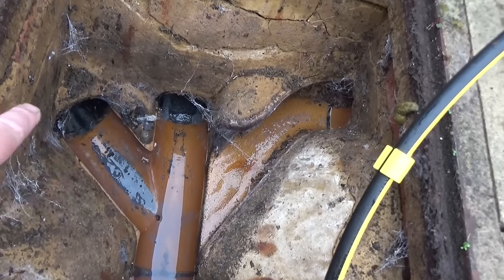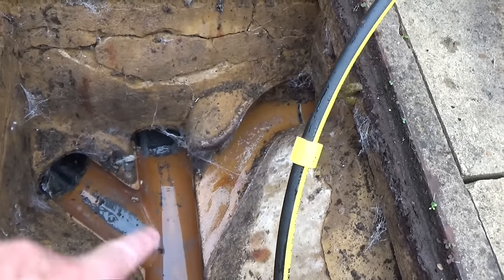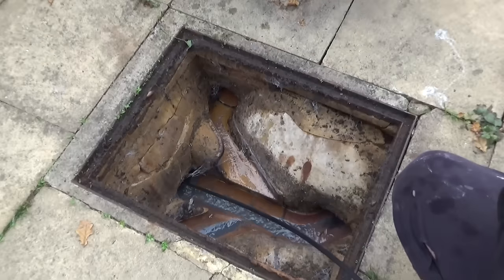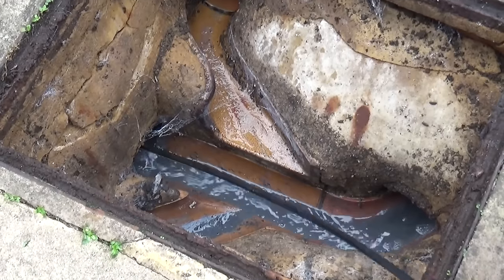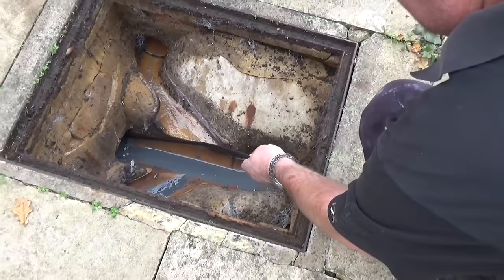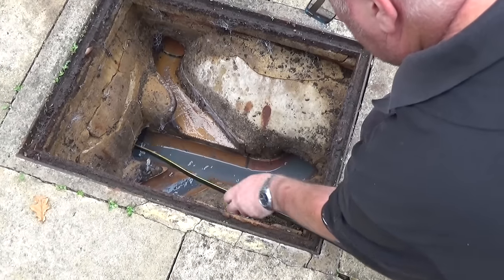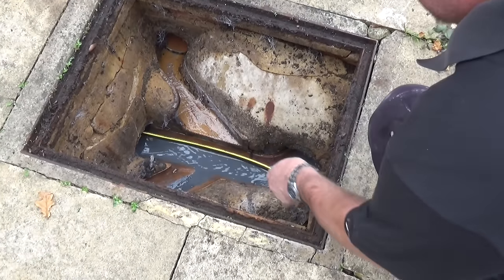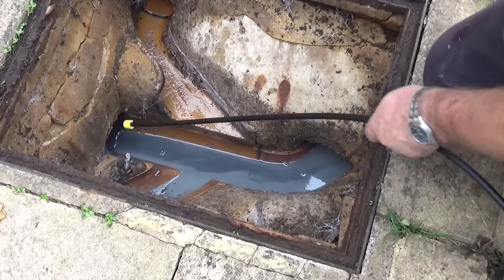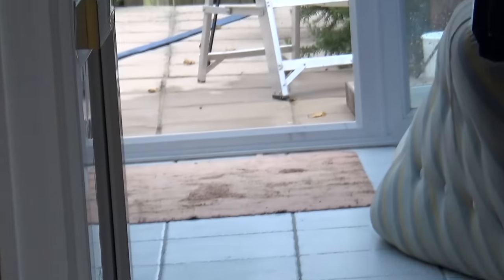On the left hand side there we've got an outlet from a toilet and a sink. This right hand side comes from the kitchen, and this is the one that goes right through the house that I'm going to jet through first. It's a really bad smell. I think I've cleared something — I wouldn't be surprised if it had come through. There's my marker — can you put the camera down the end? You can see I'm coming through the gully at the other side.